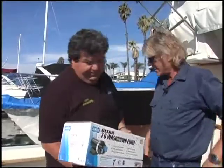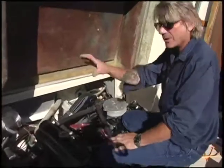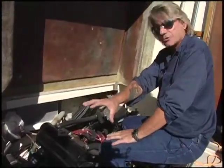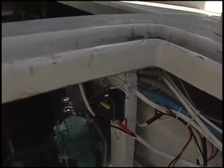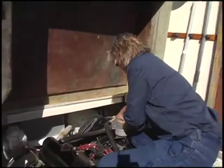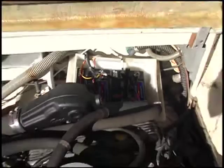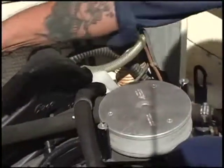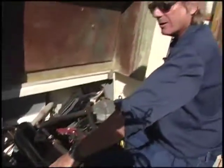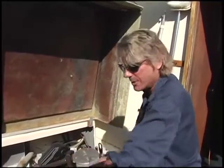Last week Greg showed us what we had to do to get ready for that, and Greg's going to get started right now. The first thing we did is we measured our wire from the battery to where the pump has to go — actually to the 35-amp circuit breaker. We connected the circuit breaker, shut it off, and then went ahead and wired our battery connections: one positive, one negative. Red wire to the positive, black wire to the negative. Then we ran our wires and tie-wrapped them to make a clean install. Now we're ready to remove the old pump and put in the new one.